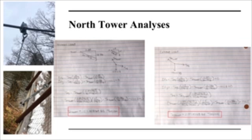And so technically we're also able to find the tension that goes to the next cable as well, but because we already know that the tension in the cable that connects from the tower to the first hanger is the maximum tension, because we know that the maximum tension occurs near the very top of the tower. So our tension in that section for the normal load would be 1,511 pounds approximately, and for the extreme load would be 2,197 pounds approximately.